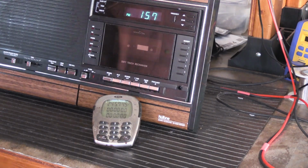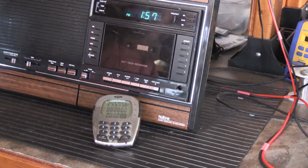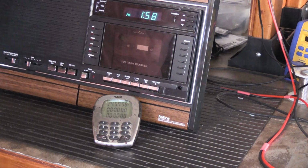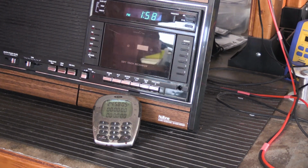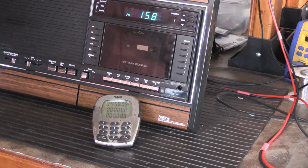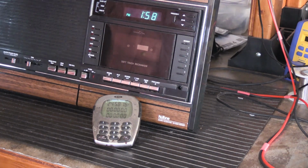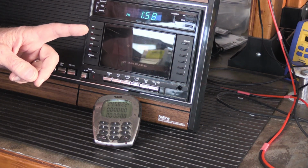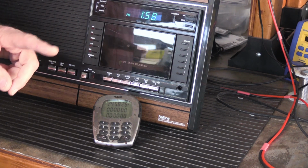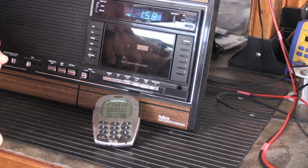And that's why in schools, like when I was in elementary school, lots of times, because every classroom has a clock, right? And those are all analog clocks because they have hands and second hands on them that go around. Those are usually part of what's called a master clock system. So in the office, you have the master clock, and the master clock is the one that feeds signals to all of the other clocks in the school. So if you set the master clock for 8 o'clock in the morning, all the other clocks say 8 o'clock in the morning, and every time the master clock ticks forward 1 second, it sends a signal out, and all the other clocks in the school tick forward 1 second also. So they're all synchronized together electrically.